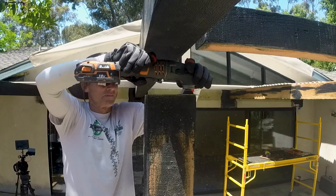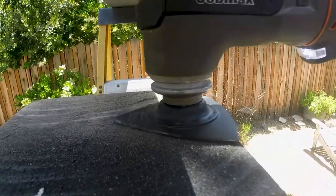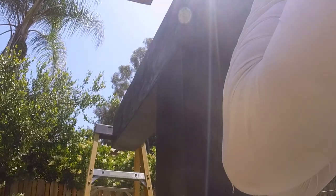I used my multi-tool with a grinder attachment to flatten out any high spots and remove some material off the top back side of the post. Then used a carpenter square to check that it is square and flat. Time to lower this beam back down